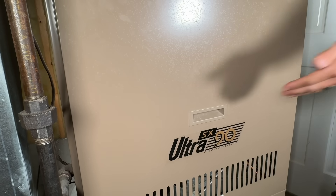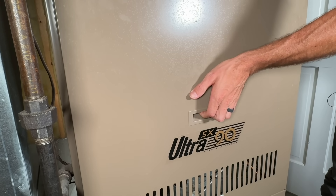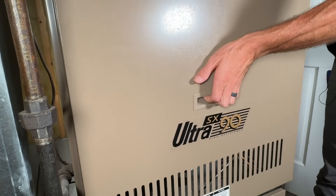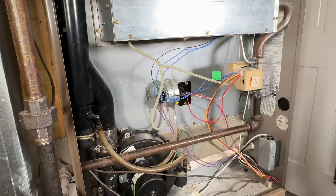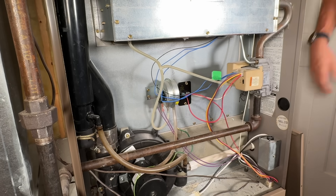So let's start opening things up and begin with that single pole light switch. Make sure your circuit breaker is off before you start, then open up the service panel to access the wiring inside and get a handy box in place for the switch.